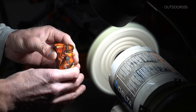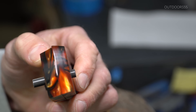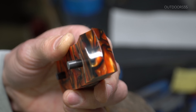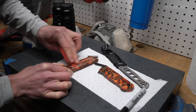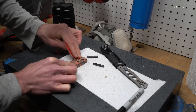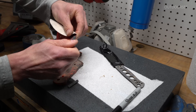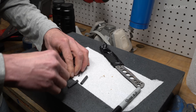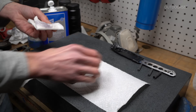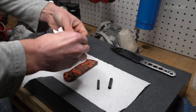This is basically what it looks like once we're done. Now I'm going to rough up the inside of the scales with a very fresh 60-grit sandpaper — we want to make sure that this is super rough so that the epoxy sticks to it. We are also going to rough up our pins. Don't forget the pins. Then clean everything with acetone — do this a couple times and make sure there is zero dust on anything so that the epoxy sticks.